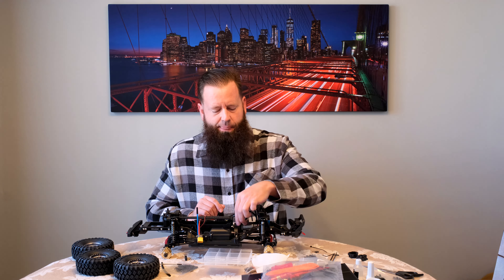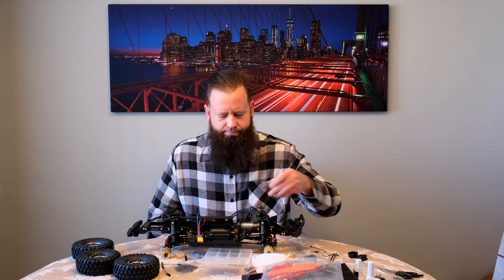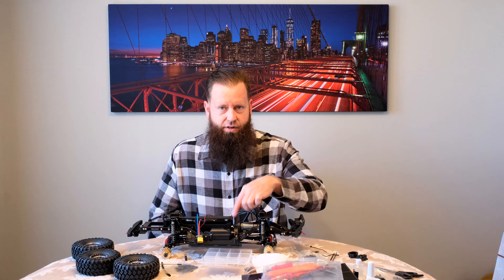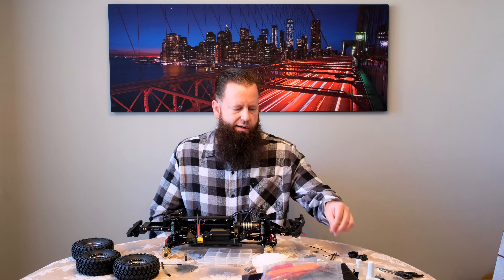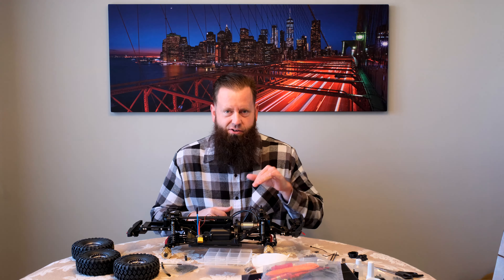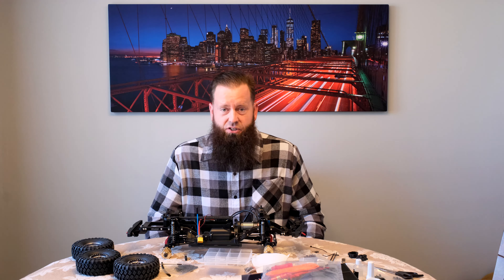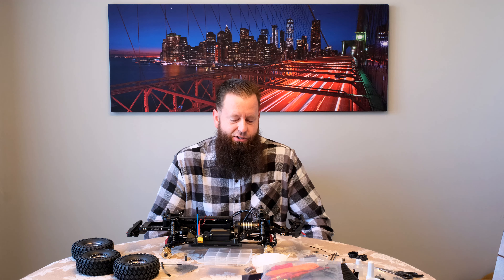I got the motor in and mounted. I was trying to figure out what gear to use. The X550 motor comes with a 12-tooth pinion, but there isn't actually a whole layout on the motor mount to even take a 12-tooth pinion with the stock spur gear — you'd have to go to a bigger spur gear. I also don't want the thing too slow. It's not a strictly crawler vehicle. I like the trailing aspect of it more, and I'd still like to have some wheel speed if I ever want to get some punch and really take it off a jump or something. So I went to a bigger pinion — I'm doing the 18-tooth. We're going to try that and see how it goes.